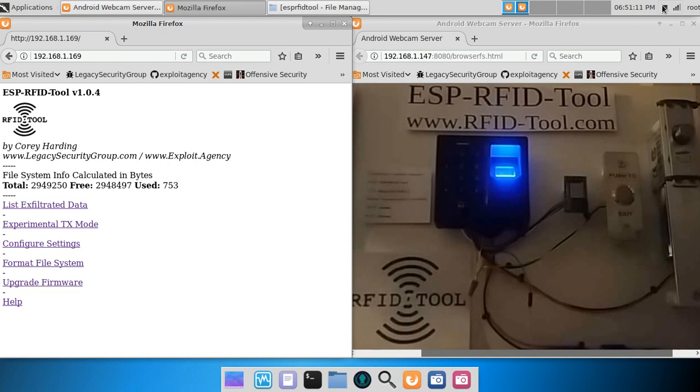When a valid RFID tag is read, the user ID that the RFID tag is linked to is output via the Wiegand interface and the electronic deadbolt opens. The same is true for the biometric reader and the keypad. When a valid entry occurs, the user ID number linked to the credentials is output via the Wiegand interface and the electronic deadbolt opens. Although when invalid credentials are entered using the biometric reader or keypad, nothing will be output via the Wiegand interface.